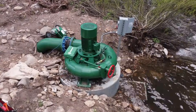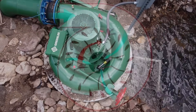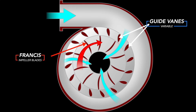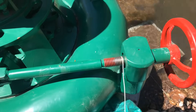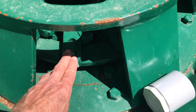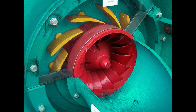While there are many environmental impacts of large-scale dams and utility-grade hydroelectricity, microhydro seldom shares those problems. A Francis Turbine works by adjusting the amount of water with the use of variable guide vanes. The water drives the Francis impeller blades and exits the turbine down a draft tube. The quantity of flow is adjusted with the variable shaft, which serves to rotate a ring connected to the variable guide vanes, which direct more water to the impeller, driving the electric generator via its main shaft.